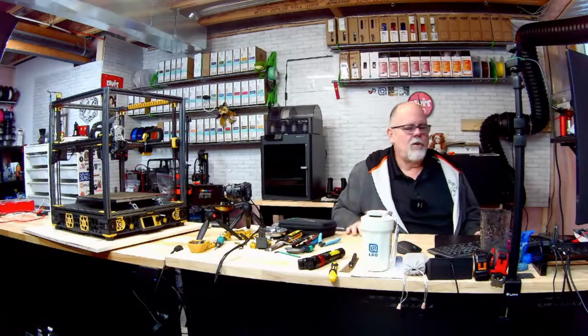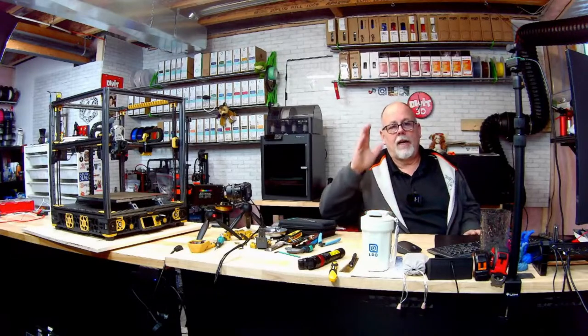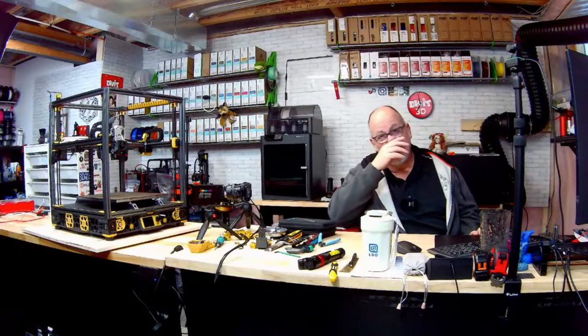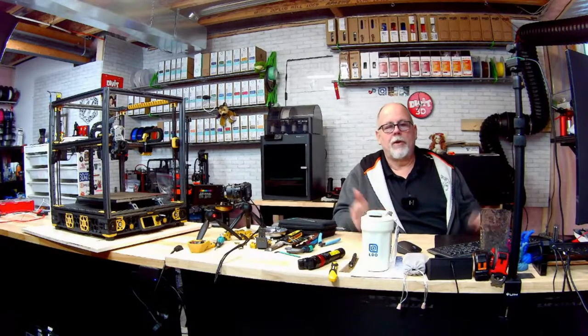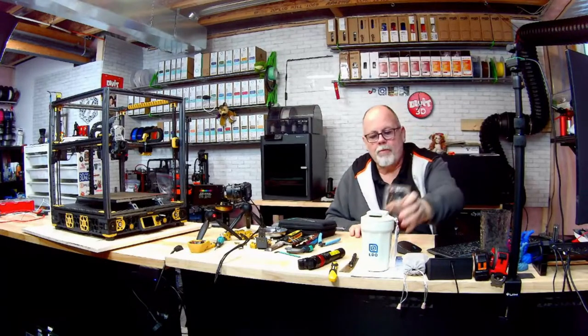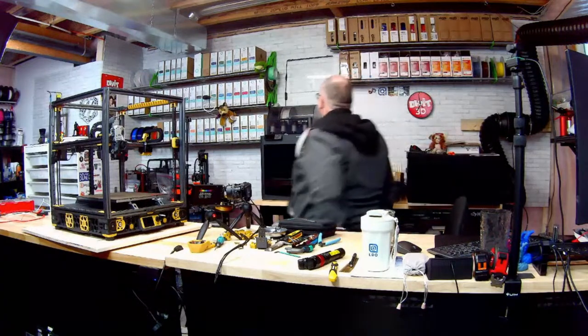Yeah, it's interesting. I went through every aspect in the config file, and I commented out anything that had to do with ADXL345, and just put in the beacon line that they say to for the probe. And when I went ahead and did an accelerometer query, it keeps coming up with the error. So I will send them that log file and hopefully figure it out one day.